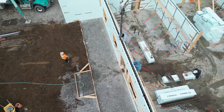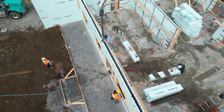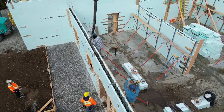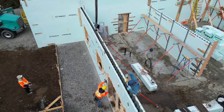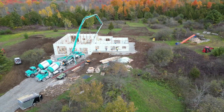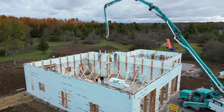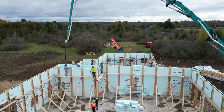This drone shot is a good view of that windowsill I was talking about — the bottom of the sill has three boards and they take the center one out, pour from the top, and the cement comes up toward that opening. Then they take the tube and just fill in the bottom of the windowsill to make sure it's good and packed in. That's how they make sure there aren't any voids — it's really only the windowsills that would have that problem. This is a beautiful fall colors bird's-eye perspective of the build site. You can also see my splitter and conveyor for the wood corral — I go into the forest, find usually dead ash trees that are already half dry, throw them through the splitter, and pile them up off the ground so they're dry and ready to burn this winter.